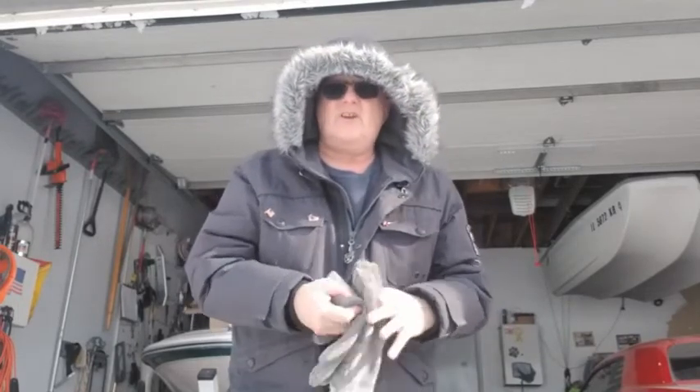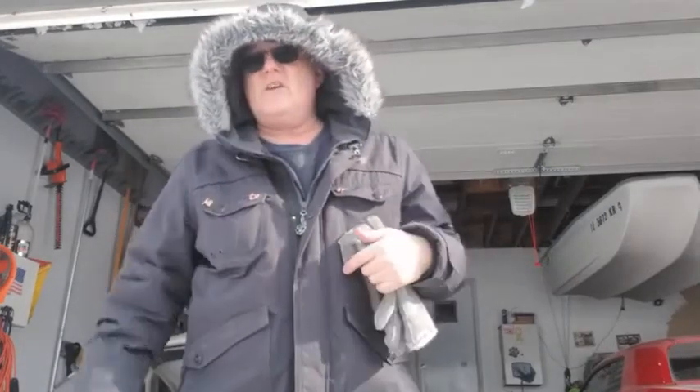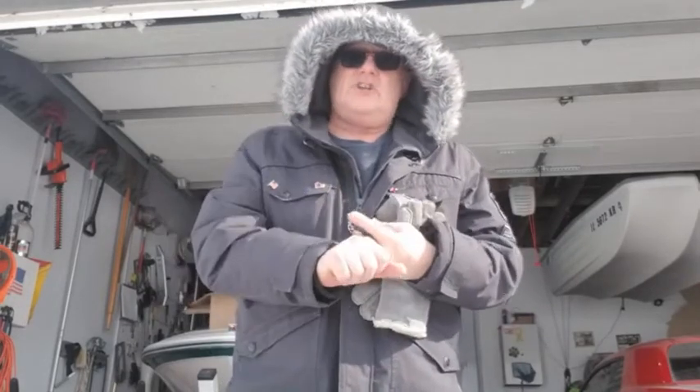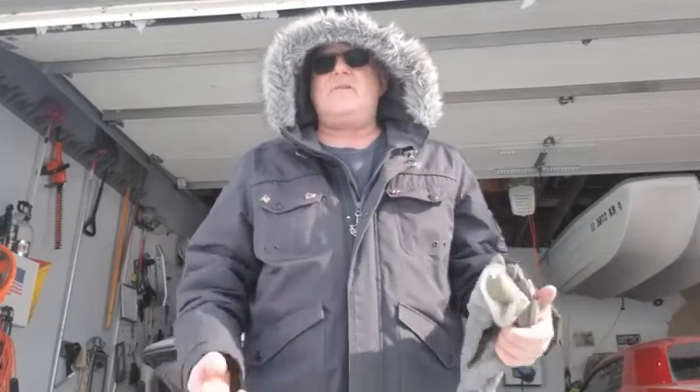This is absolutely a fun project, where your gloves wouldn't zero out or your fingers stick to the tube. But thumbs up for the Greenlee 1818 Bender. You look online — these things are $1,800, $2,500, over $4,800 for a new one with all the wheels and shoes. Now if you go to buy EMT and your thin wall tube, make sure when you buy your shoe, you get your follow board or follow piece with it — it's a piece that goes on the bottom to stop the tube from kinking. If you don't get that, you've got a problem. Double thumbs up — $300 for the bender, shoes we paid about $60 a piece for. I'm in this with shipping for under $750. If I don't like it, I can sell it and probably turn a profit on that too.